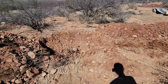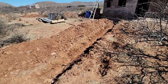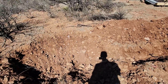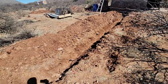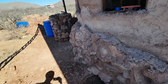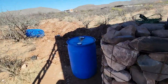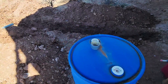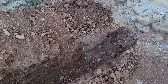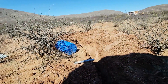Had the neighbor come over and help us out again — very excited. This trench took him like two hours, maybe less than that, probably with the hole. Our previous digging efforts took like all day and backbreaking work. So he dug out our septic lines for this house. We're doing the 55-gallon barrel thing — just for our kitchen sink. We've got two barrels and then a little leech line.